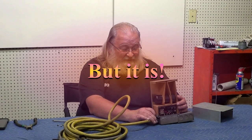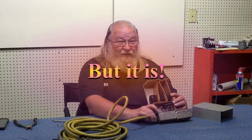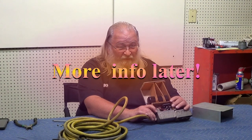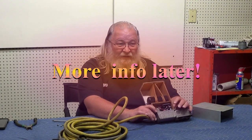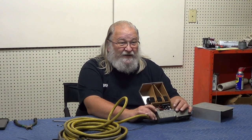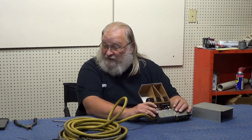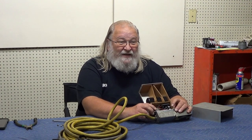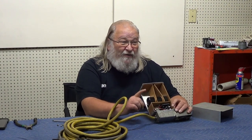Cardboard is not really a good idea in today's world. There are polymers you can buy that create good insulators and don't get affected by heat like cardboard does. The downfall of this device is you will not get the starting torque you would get from true three-phase power. With true three-phase power you have three phases that are 120 degrees apart in their AC sine wave generation. With 220-volt single-phase you have two legs that are 180 degrees apart, and this device bends one of those phases to make it 90 degrees apart — which all relates to torque.